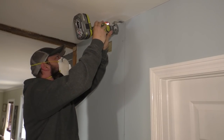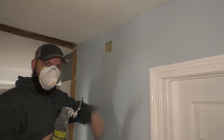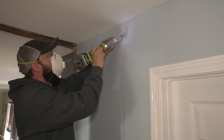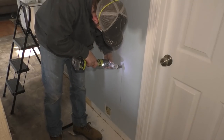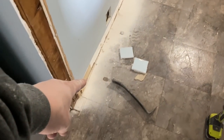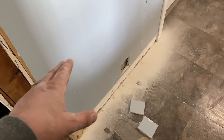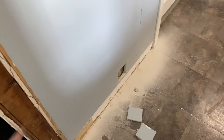I'm going to take my tool and cut the top here, then cut all along this line. By the way, if you didn't have this tool, you could just use a knife and score it several times, but you should have this tool — it's awesome. That's a pretty decent cut. Now I can take this drywall off. I'm not doing this entire wall because it's a lot of work and I don't want to mess with that door. Where it really counts is right here where you're going to see it. This is just cosmetic — all it's going to take is some 2x4s, some mud, and a new sheet of drywall.